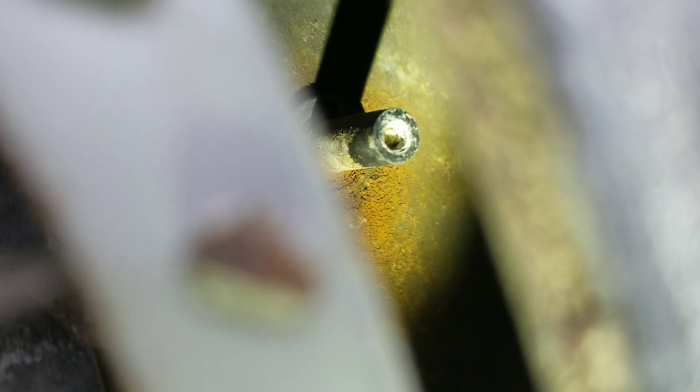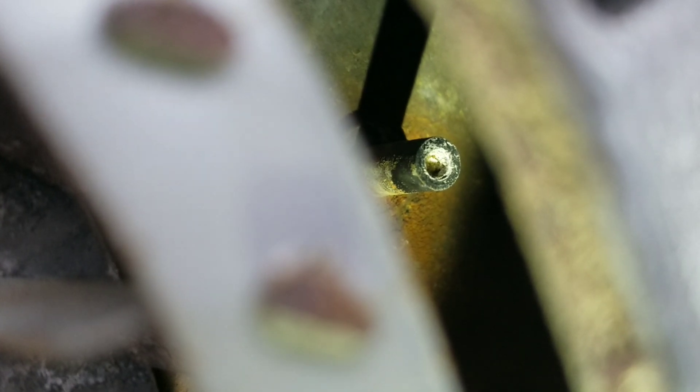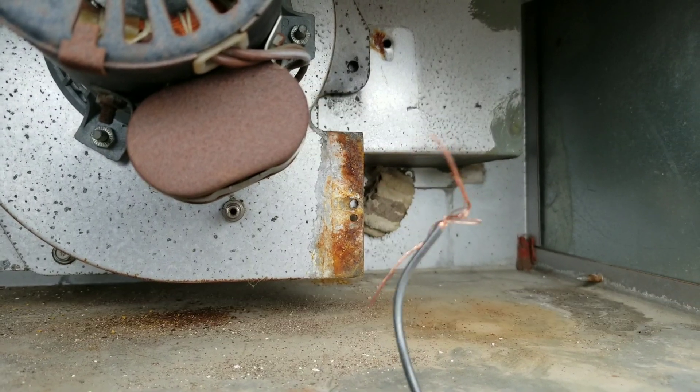I know it's hard to really see inside that port, but it is plugged up — you can kind of see a little bit of it right there. My camera won't focus well, but what we've got to do is just get a piece of thermostat wire or a paper clip or something, jam it in there, clear that port out, then cycle power and see if it starts up. Alright, jammed a piece of wire in there and cleaned that port out.